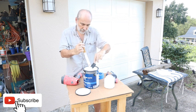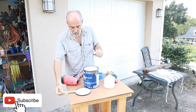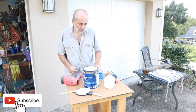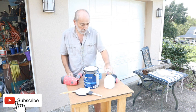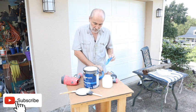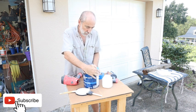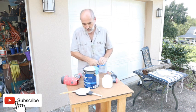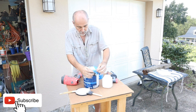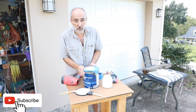All of the wood in my van build is coated with a thin layer of polyurethane. I mix polyurethane with some mineral spirits to make it thin enough so I can easily pour it and put it on with a rag. I do that specifically just to seal the wood. And then I put a coat of mold killing primer. I'm doing that everywhere, even in places that you can't see, because I don't want mold to grow. I'm overly sensitive to the concept of mold because I'm doing this in Central Florida, and we have high humidity here. If I was out there in the upper Northwest, I probably wouldn't be as concerned.